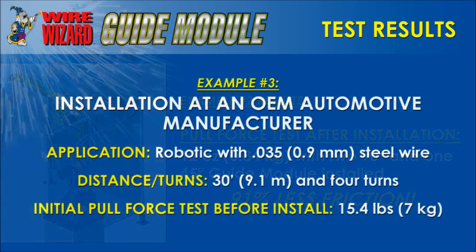Our final example is an OEM automotive manufacturer who is using 35 thousandths diameter solid steel wire in a robotic application. The original conduit run was 30 feet in length and required 4 turns, of which 2 were 180-degree turns at the robot, creating a pigtailing effect up to the feeder.